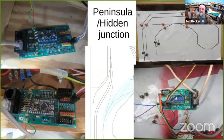You see the track plan. There are 8 push buttons that I've actually hooked up. The 8 push buttons are connected to this Nano on one of my shields, and it's literally just double-sided taped to the back of this panel. And I started out using RJ45s for the network connection, and I have since changed to the tap line that I showed you. So this node is the control panel. This node up here controls the three turnouts at the end of the passing siding, and the node down below on the left controls these two turnouts.